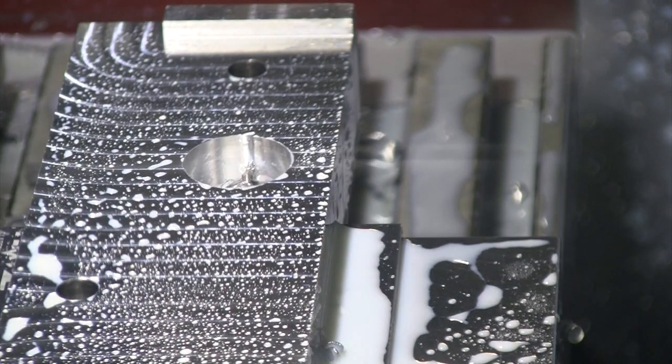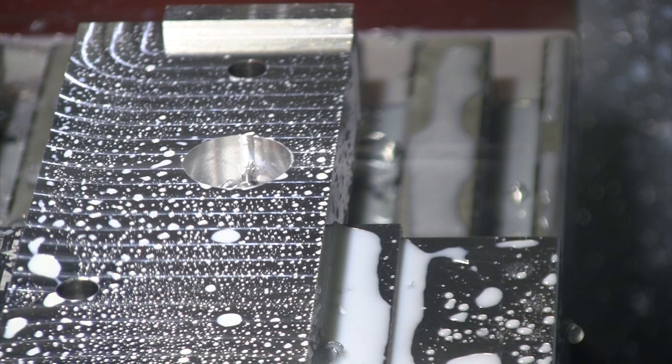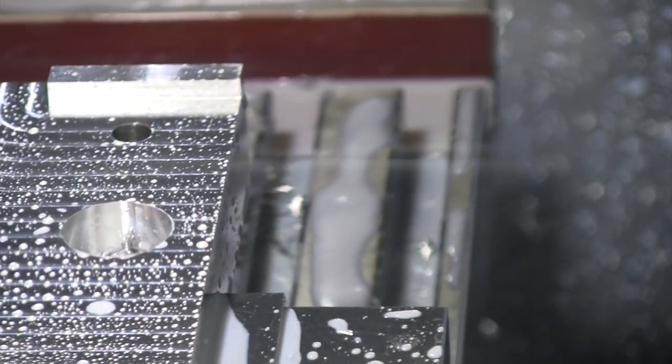Well, I really thought there was enough meat there to hold that drill centered up in that hole, but I also really should have known better than to try to drill that nub out of there. Should have machined that one out and then tried this other process for getting rid of the rest of them. I will say it does work significantly better going forward, so it bores those holes out a lot better with the meat gone out of the middle, but yeah, that was a fail.